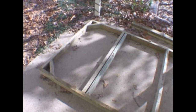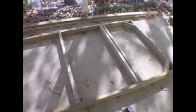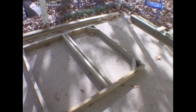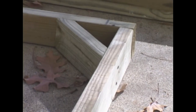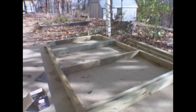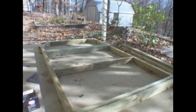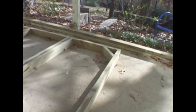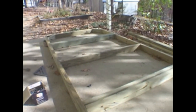This frame is custom made for four panels. The spacings are set so that the edges of the panels lap right over on those vertical two-by-fours for mounting. I'm going to use stainless steel mounting hardware in this case. The corners of the frame are rigidified by using diagonal inset pieces, and the entire frame is screwed together using outdoor decking screws. You need to measure from the far right corner all the way down diagonally, and from the far left corner across, and be sure they're identical — that way you know the frame is straight and true.